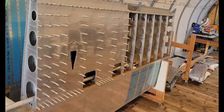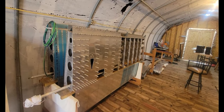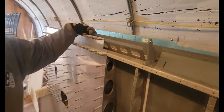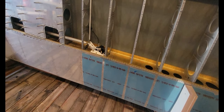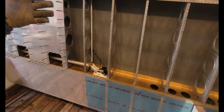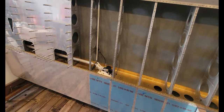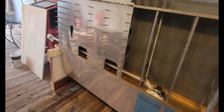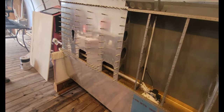Then about a year later, Bob calls me and says, 'Hey, I found you some wings in Southern California.' This was a quick-build set from a second-hand owner. The first builder had unfortunately mounted the flaps to the top skin and basically ruined both top skins, drilling holes where there weren't holes to be drilled. So we ultimately reskinned the top skins, unriveted and de-riveted the entire wing except for the leading edge - we had one leading edge we had to replace because of some hangar rash. It was pretty amazing - about 400 bucks for all of these skins. So you're into this a round figure of about 3,100 bucks total. The previous owner didn't want to deal with the work, and that's why you got them cheap.